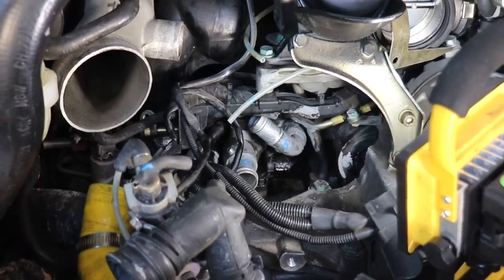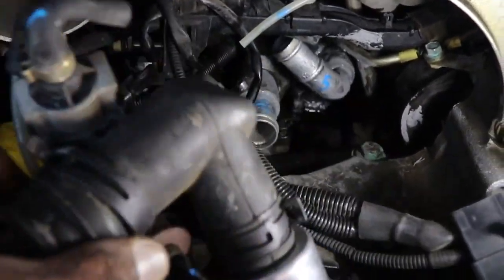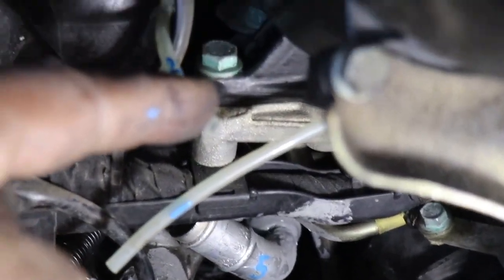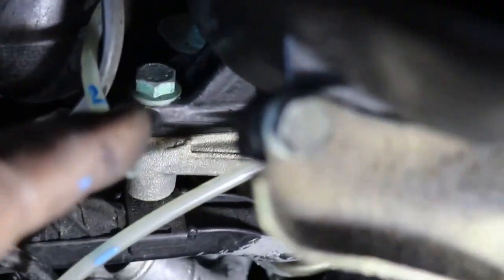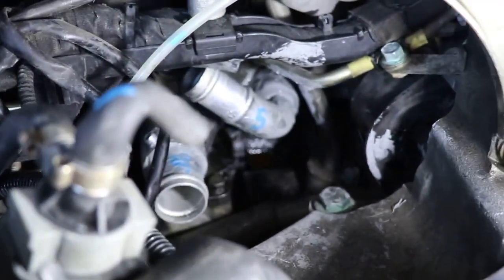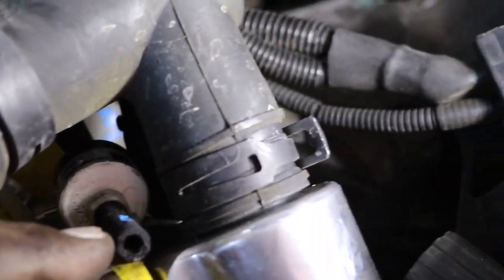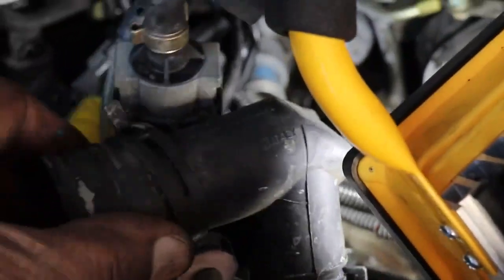Okay, on my journey to drill number 5 that you see in the back there, I removed my diverter valves. And in so doing, I took loose my vacuum connections to different locations on the diverter valve. You'll notice that I numbered them. Number 2, number 1, and correspondingly number 1 goes here on this elbow, and then number 2 goes down here on this check valve. Those are breadcrumbs to help you find your way back when you're putting everything back together and minimize the amount of questions you have to ask on the forum.